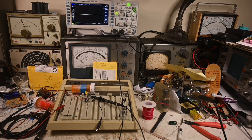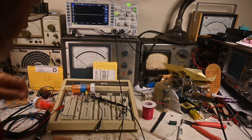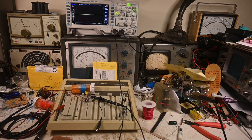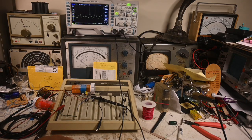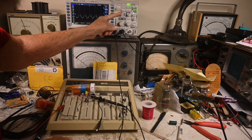I've changed the coil — let me double check. Yeah, everything's plugged in. This is the 20 and 23 coil now on the pill bottle, and the output is a higher frequency: it reads 877 kilohertz. But the output level is much higher too.